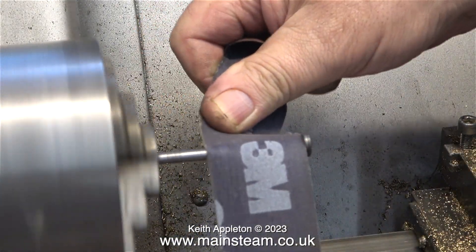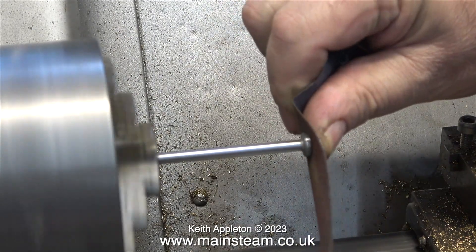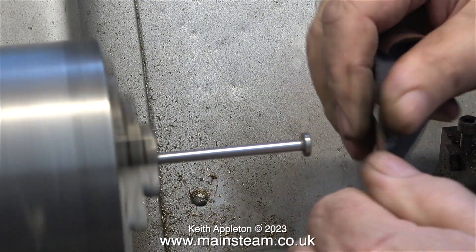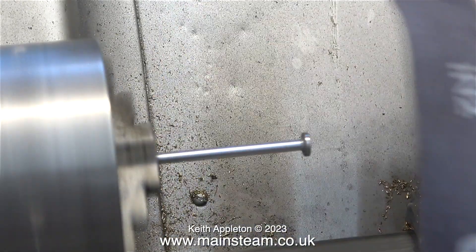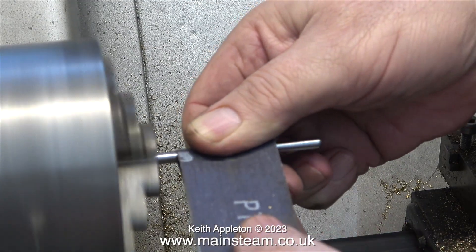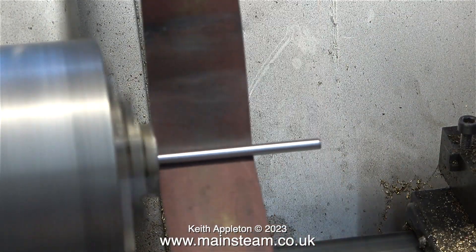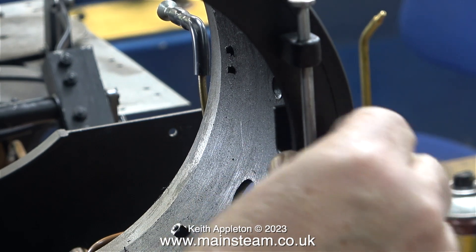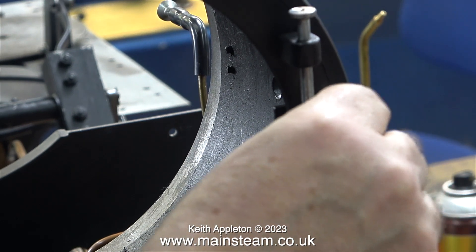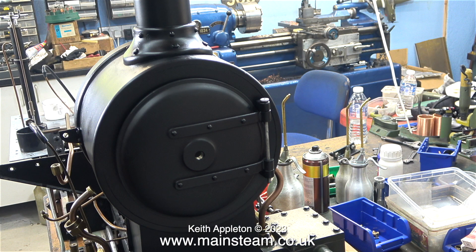I'm going to leave the blast pipe in the outer part of the workshop because it's colder out there and I need it to cool. So what I'm doing at the moment is cleaning up the pin that holds the smoke box door. The pin is fitted halfway into the chuck of my Myford lathe and I'm using some medium grade emery cloth just to clean it up and reduce its diameter slightly. After being very careful not to catch my hands in the chuck, I turned the part round and did exactly the same to the other end. This took a good bit longer than shown in the video because I did have to remove some metal — the pin was too big to go through the hinge mountings. There's no point in having this pin too thick; when I removed it previously it really took some doing, requiring quite a lot of pressure with a soft hammer. But now the fit is good — the hinge pin is not slack and not tight; it's just right.